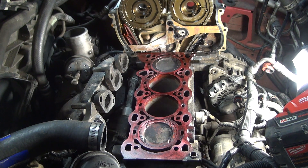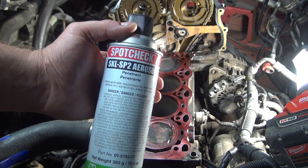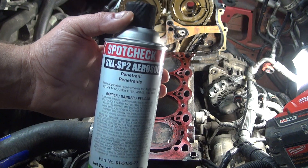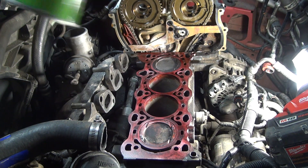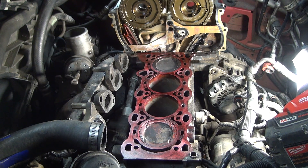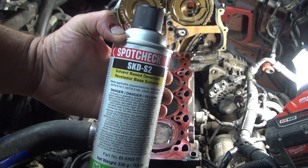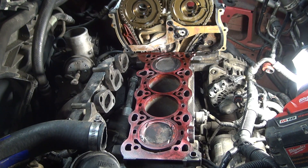You can get different colors too. This is the penetrant — Spot Check by Magna-Flux. I got it from Grainger. It's a three-step process: the red penetrating dye, then a cleaner (Spot Check SK-CS), and finally a developer (Spot Check SK-DS2 solvent-based developer). These three bottles were just under a hundred dollars — pretty expensive, but it lets you check for cracks in the engine block.